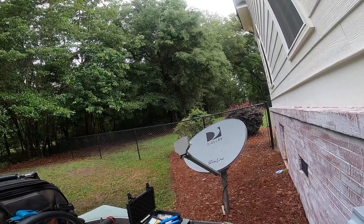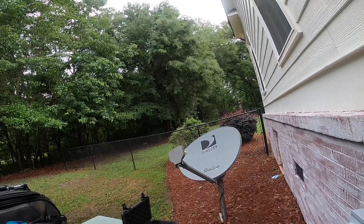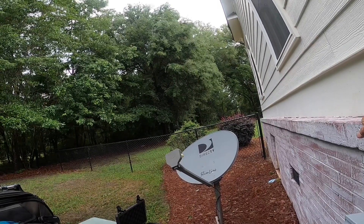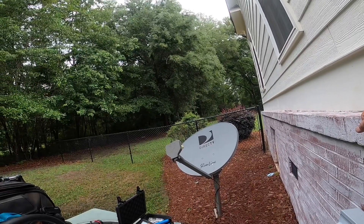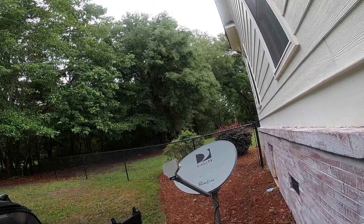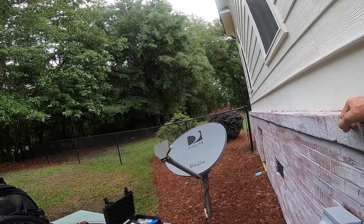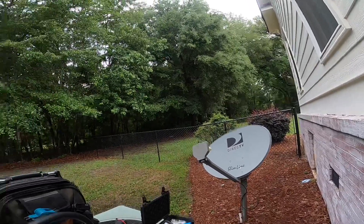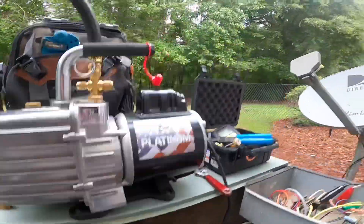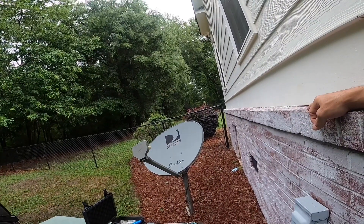This is an R22 system, but I could not fully verify which refrigerant was in it. I think it was R422 — that was the closest I could come to. I did not think it was the TXV; I think it was the Freon giving me trouble. I had about a 30 to 40 percent capacity loss, and it was not because of a dirty coil — it's a little bit dirty, but that's not my reason. I believe my reason was the refrigerant, so I recovered the Freon and we're pulling a vacuum.